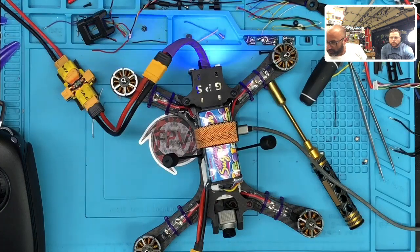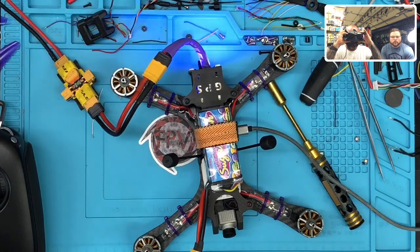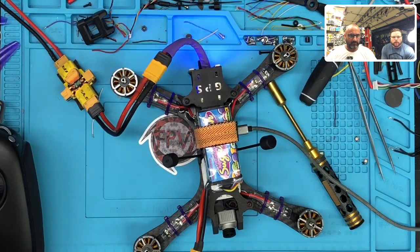Okay, so what you have to do now is come over here and go to our controls and tell them to reverse everything, okay? So you press this down, go to your remote controller, and if you go to your servo setup and go to your option for reverse, put the aileron and elevators to normal and reverse the throttle and the rudder. And then I believe, can you try now? This should, there you go. Yep. There's throttle on there. Yep. And there you go.